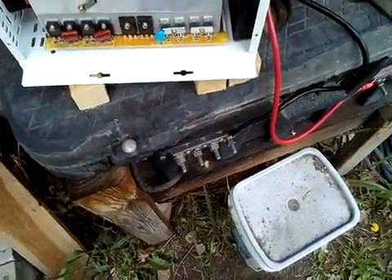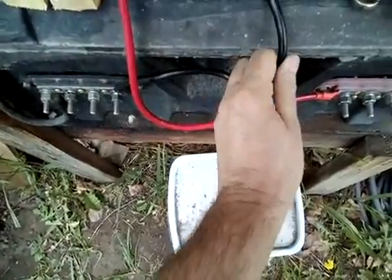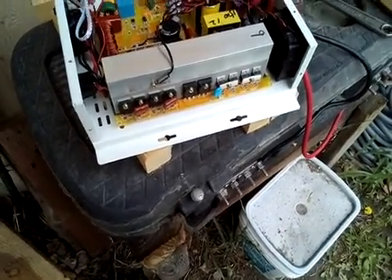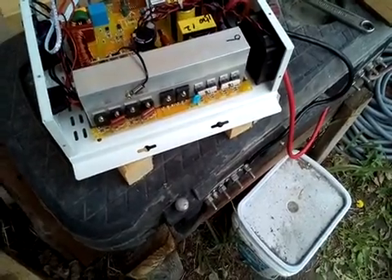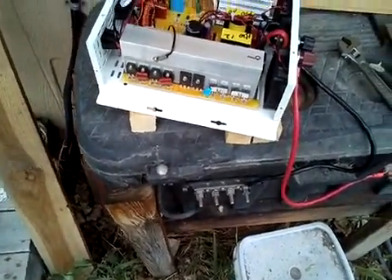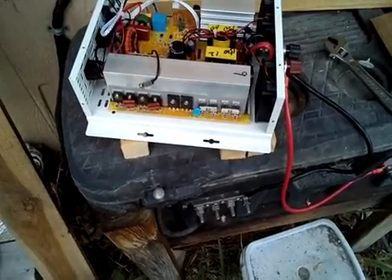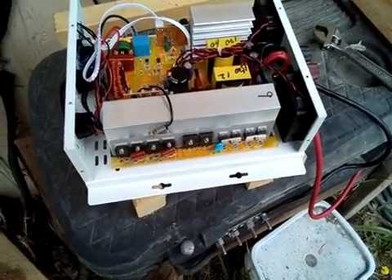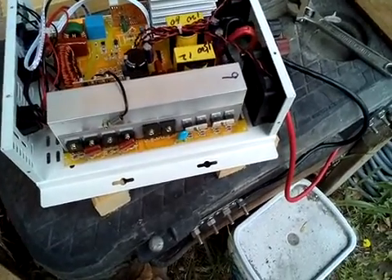I am using their cables — they're warm but functional. I already made a brand new set of cables for the other inverter and those will go on this one. This is supposed to be a 12-volt 1500-watt inverter. To run it safely, I would stay no higher than 1100–1350 watts. If you're pushing 1500 watts, you're pushing the complete limits of how this is made. I keep it between 1100 and 1350 watts — I would not try to run the full 1500 watts on this inverter.